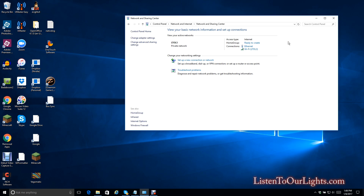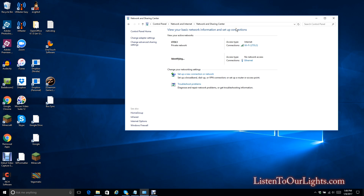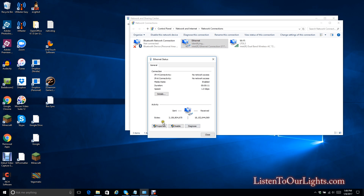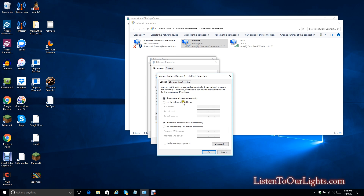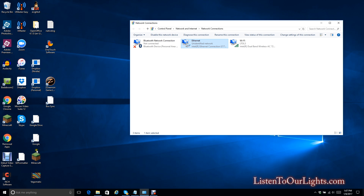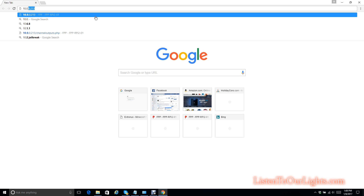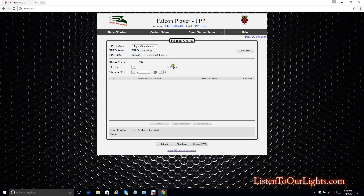So now we're on the computer. One thing I don't have set up is I'm not connected into the hub like I'm supposed to, so let me go set up my Ethernet. I have my Raspberry Pi and my controllers on a 10.0.0.0 network. So I go over here to change adapter settings, go to Ethernet, Properties, scroll down to IP4, and I'm going to use a static address — 10.0.0.200. It's an eight-bit netmask and I don't need to set a gateway or any DNS. Now I've got my Ethernet all set up. I open up a web browser and go to my Raspberry Pi, which is at 10.0.0.213. I want to set up those two strings, so I go to the Input/Output Setup tab.